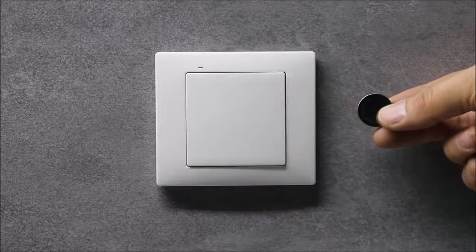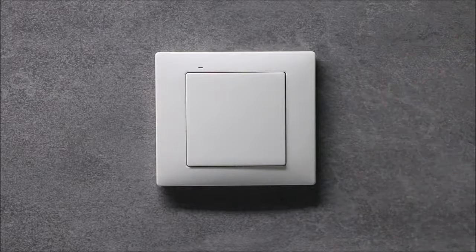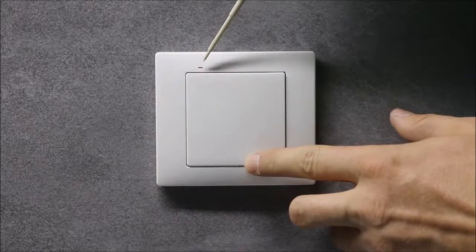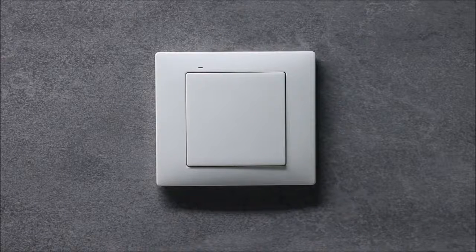The transmitter is powered by a single CR2032 battery. The battery discharge status is signaled by several blinks of the LED during normal transmission. The advantage of the RNK-02 transmitter is that battery change does not require disassembly of the transmitter from the installation site.